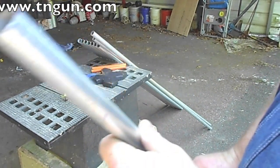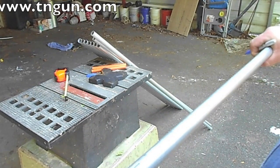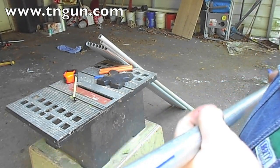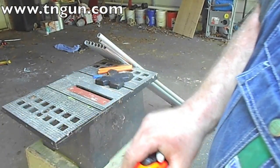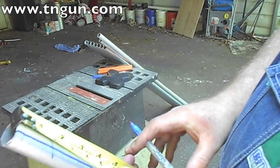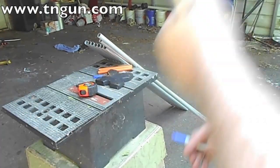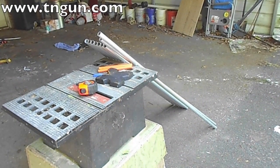I've done that on both ends because you want to make sure — I'm going to make a jig to do it — but you want to make sure that if you smash this end flat, you smash it the same way on the other end. If you get the smashed ends cattywampus, it won't line up. I'm marking three-quarter inch so I know how far to stick in my arbor plate to smash it. I've done that with my five-foot poles, and now I'm going to smash them.